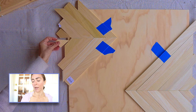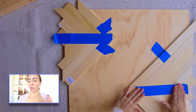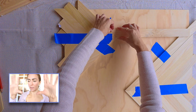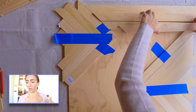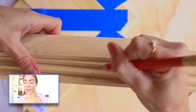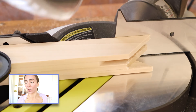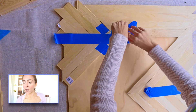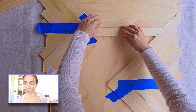More tape, more planks. Once I have a bunch of boards in place, I just put a piece of tape to hold them together. To fit pieces between these two triangle shapes is a little trickier because you need to get that exact measurement — you can't have the overhang. So I just laid a piece down, tried to mark where I needed to cut it, cut it on my miter saw. And then when you go to fit them in, if it doesn't fit quite exactly, I just sand it down with a sander until it fits.